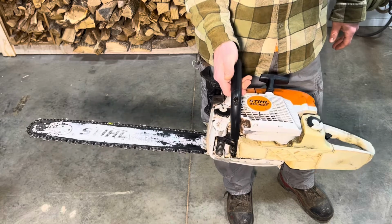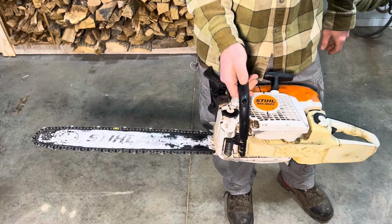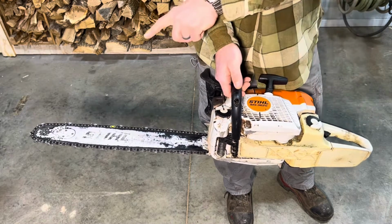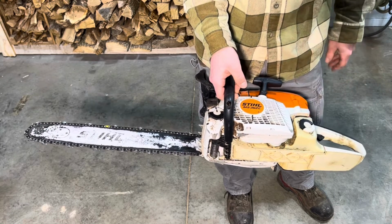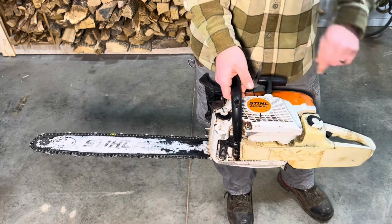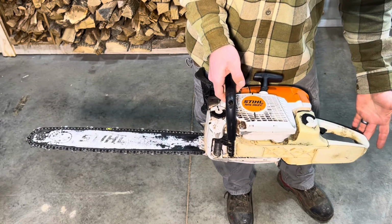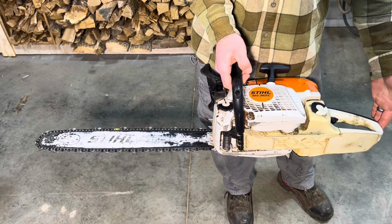Same thing here, we're going to grab the saw by the side of the front handle. Grabbing the saw and balancing it by the side of the front handle, I'm going to look at the orientation of this horizontal to the ground. When I hang on to it in this fashion, again, you're getting the view of the operator, you can see now that my tip is up on the saw and that my power head in this orientation is further back. So if I'm just balancing the saw in my hand, I will not have a level cut. I will know that that saw bar is up, and so before I can get a level cut, I'll have to apply a slight upward pressure on this handle to achieve a perfectly level cut.